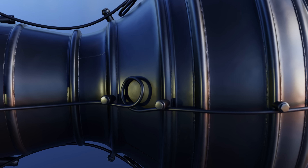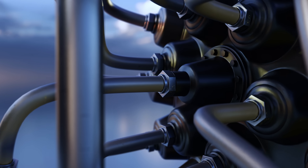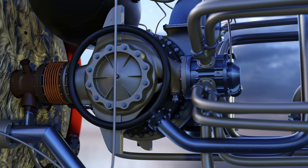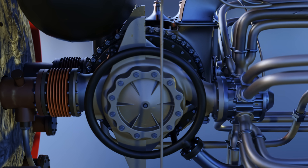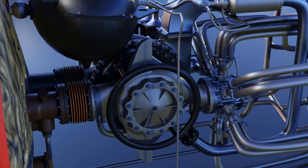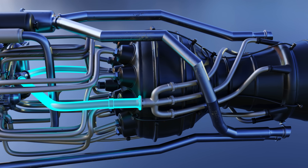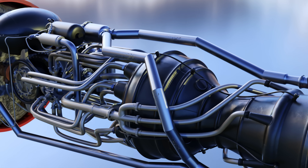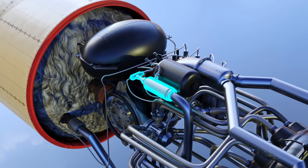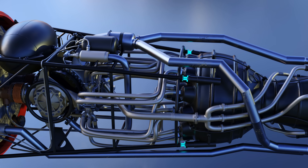If too much fuel was pumped into the space between the double walls, the pressure could cause a catastrophic explosion. To counter this, a valve would release high pressure before it could reach dangerous levels. The supply of fuel under high pressure was provided by a turbopump — essentially a steam turbine that drew fuel and liquid oxygen from the tanks and fed them into the chamber through separate valves. The liquid oxygen valve connected directly to the burner cups via 18 pipes, while the fuel valve directed fuel through two large pipes splitting into six sub-pipes. The steam generator, its fuel tank, and the turbopump were all mounted to a frame attached to the combustion chamber via four large bolt joints.